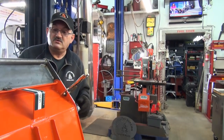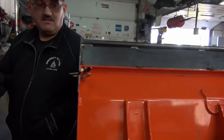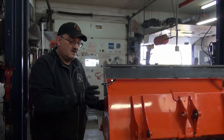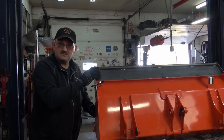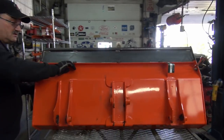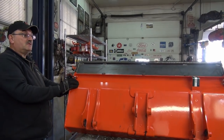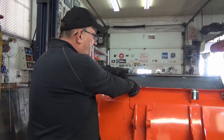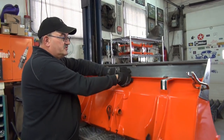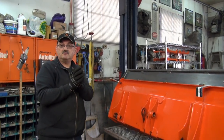Okay. Right? Now, you do the sides first. Bolt, bolt, and then what happens is if you look down, you probably won't see it with the camera. These buckets, of course, were fabricated as well as this one. But in a lot of these buckets, this lip has got a slight warp in it. So while this is bolted on, you can literally get here and just push this out a little tiny bit, drill it out, and then put your nut and bolt on here. Cool. And you're good to go. That's the install. Absolutely perfect. Okay?